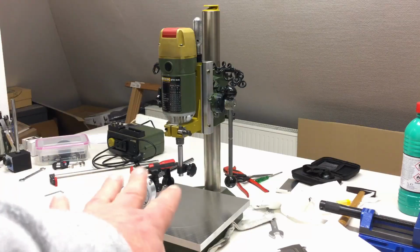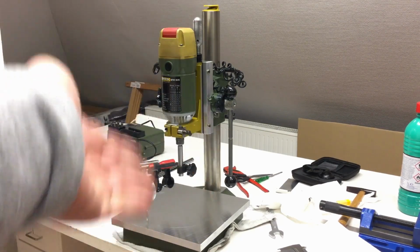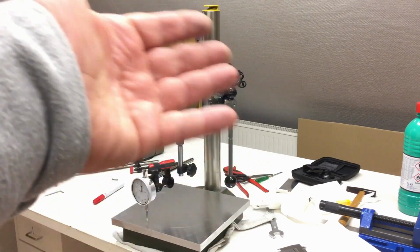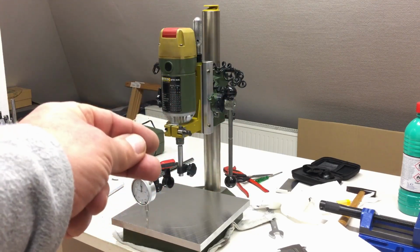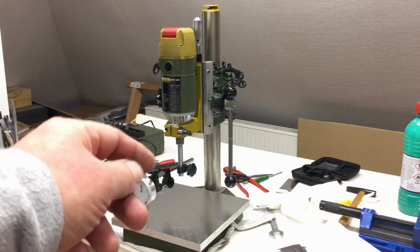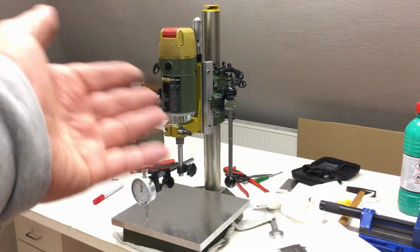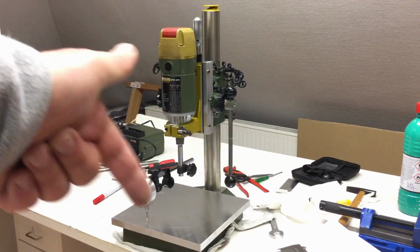Enjoy! This is Robert from the future, after I finished tramming that thing. This will not be a straightforward tramming tutorial because I ran into different problems while I was tramming. Most noteworthy, the run out of my spindle itself, which made tramming more like a statistical thing than straightforward.